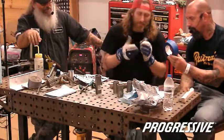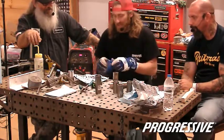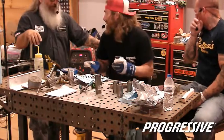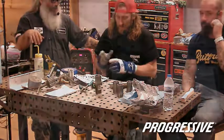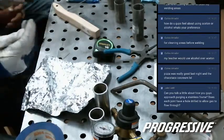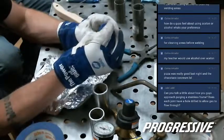So you could tape the end. Like I said, this is sticky enough it's not going to come off, but it's not going to leave a lot of adhesive on a polished part that you need to prep again, or a brush, because again, like you said, the stainless will leave marks. And if you're looking for a finished, raw product, you definitely want to plan ahead, you're still going to have to acetone it. But this is an easy way to peel off. And like we were talking about at the end, that's the cap part, you just want to poke a little bit bigger than this actually.